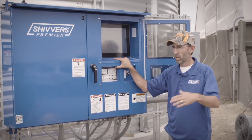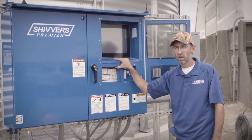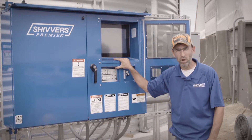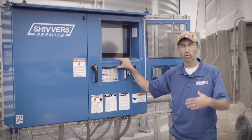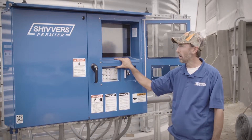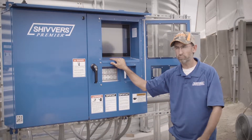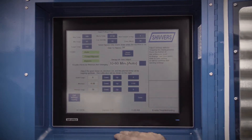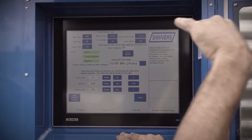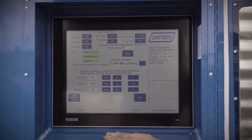For regular corn on this particular system, we're going to do a max temperature of 180 degrees for standard number two yellow corn. If we were doing something like wheat, our max temp would only be about 130 degrees under the floor because we don't want to get the kernel temperatures too hot. The minimum temperature is a temperature you don't want the computer to go below. Usually we keep it at 55 because the computer can adjust the temperature anywhere between the maximum and minimum temperature until it's satisfied with the product going out of the bin. It does that automatically so we don't have to figure that in.